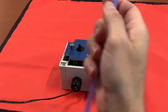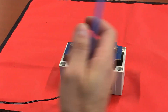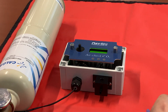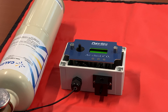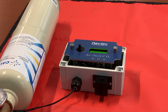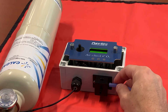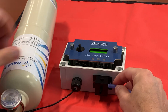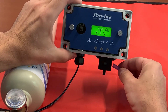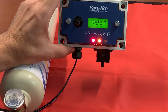I have ninety-nine point nine nine percent nitrogen. You'll want to use some sort of inert non-depleting gas on this. Try to avoid any types of freons or anything that may damage the cell. Just have a little hose attached, turn it on, and as you can see we start dropping below, and after five seconds both of your relays light up.